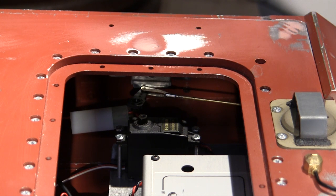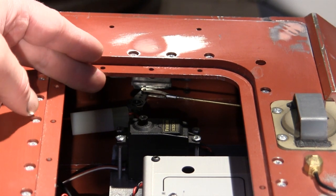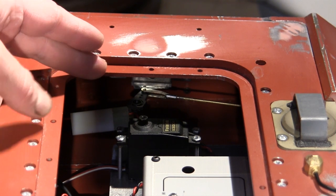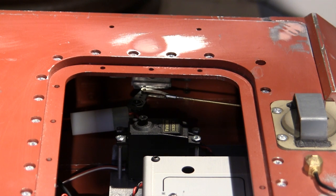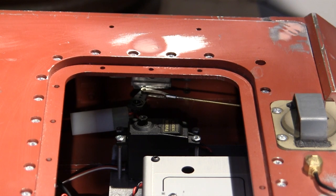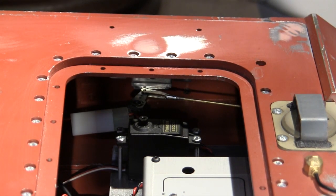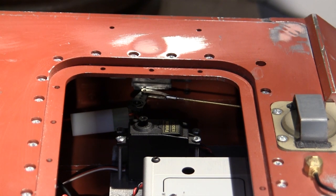You see, it's actually twofold. First, without the fastener in place, it makes it really easy to get in here to remove the clevis. And the second reason is really as a safety feature. This is the type of function that you are going to forget and not remember when it comes time to removing the top deck, say down the road, or maybe if this tank ever changes hands or whatever. Because of that, if the unit is firmly connected and secured to the servo, when you go to take the top deck off, you're just going to bend and possibly damage the pivoting function. With the unit not screwed on, if you need to take the top deck off and it's still connected, the clevis will just simply pop off of the servo before any serious damage or any damage can occur.